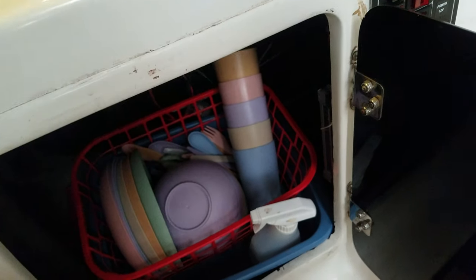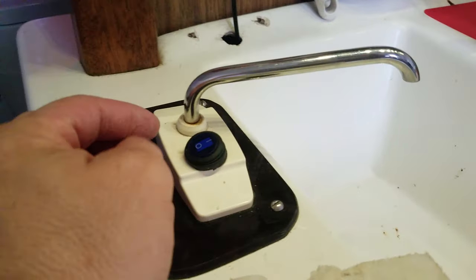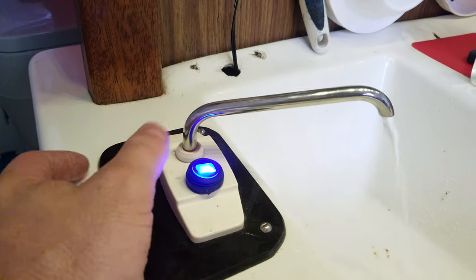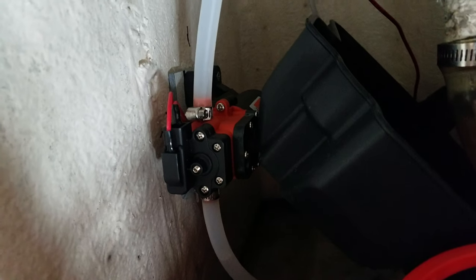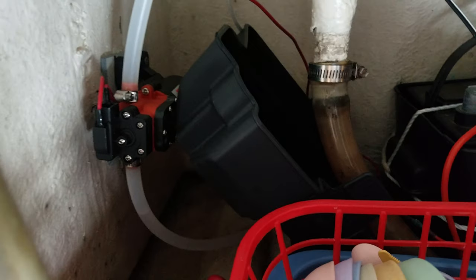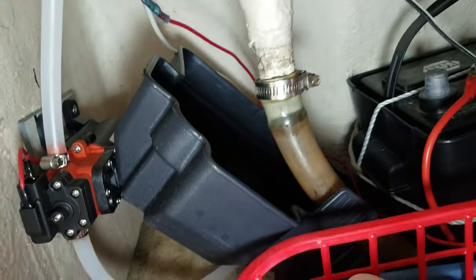How do we wash our dishes? Well, it's a little hard with one sink, but it can be done. This boat came with this factory nozzle, but I replaced the switch with a light-up switch — I was afraid without a light I might forget and accidentally leave the water running. But no one's ever going to forget and leave that water running; it's really loud. Down here you can see the pump. I glued a piece of plastic wall tiling to the inside there, and I had pre-drilled it so I could screw the pump mount to it. So it's nice and secure there and it didn't have to make any new holes in the boat.